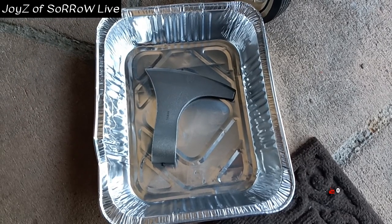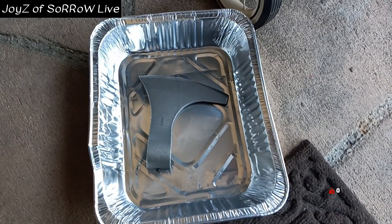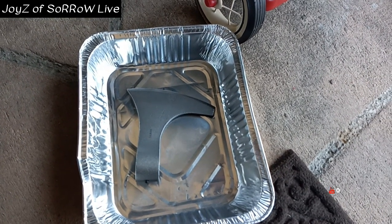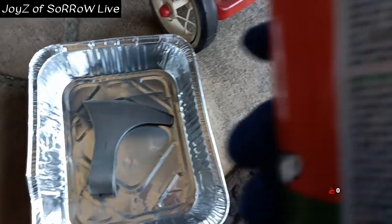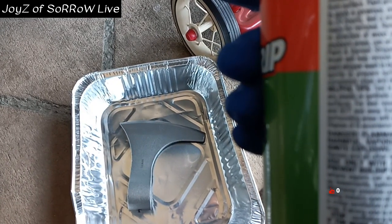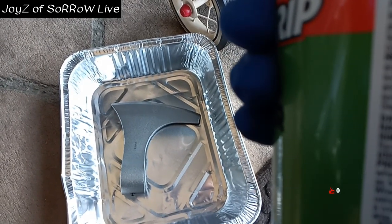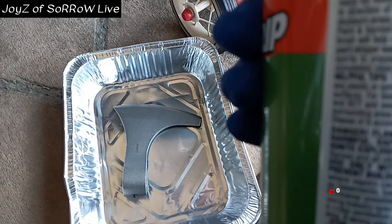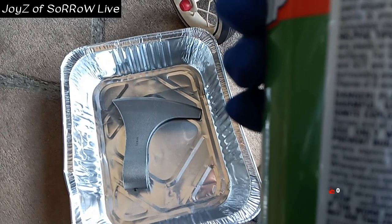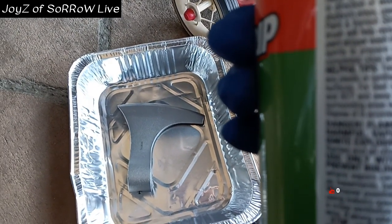Hold upright, position approximately 10 to 12 inches from surface. Point arrow button away from you and press to apply a generous coating. After 30 minutes or up to 24 hours, loosen finish by gently scraping in the direction of the wood grain with a plastic stripping tool. For stubborn areas, use an abrasive pad. A toothbrush or toothpick or stripping brush will help remove old finishes.